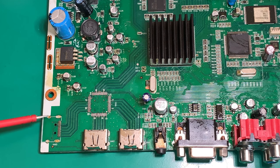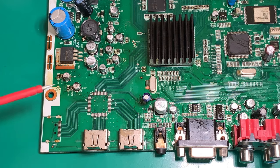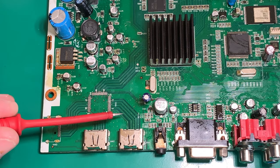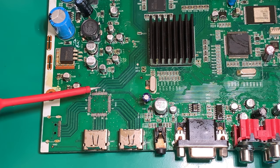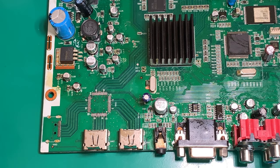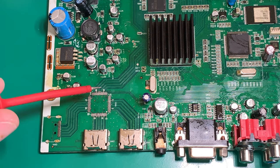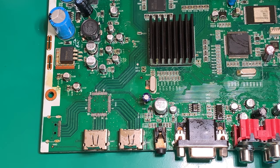What I want you to look at is down here on the left hand corner. You see there's a connector missing that's been pulled out. That's an HDMI connector, like that one. All three of these connectors come out with these matched pair signals, and they come to this square over here. Wonderful. What is glaring, and you've probably been shouting and swearing at me throughout the whole video, is the integrated circuit, the processor that will go over there. So we are now literally stuffed with this board.